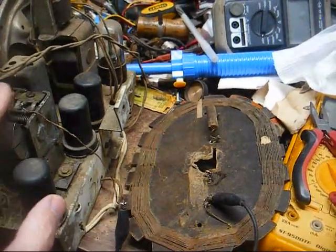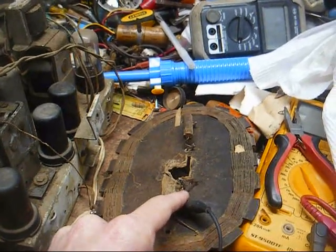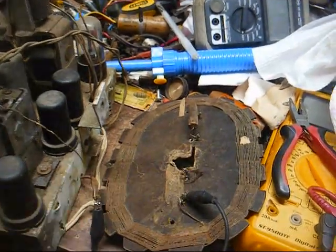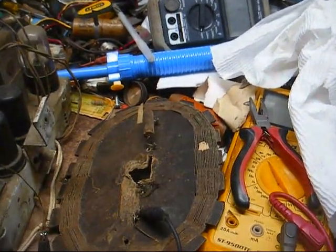They indeed had this wire connected to the tuning condenser, and they had the return lead from the secondary winding connected to the chassis instead of the AVC line. So I have it temporarily connected the way it's supposed to be.